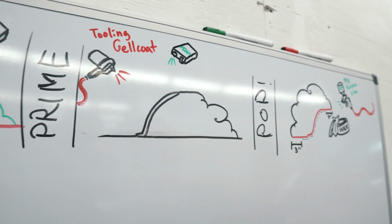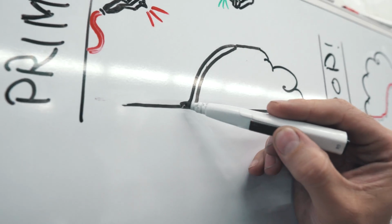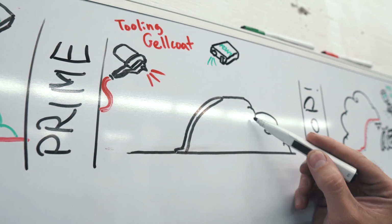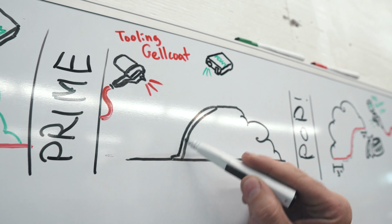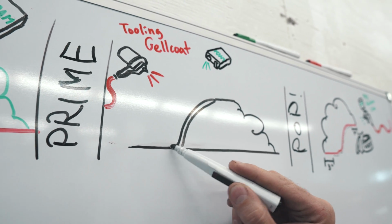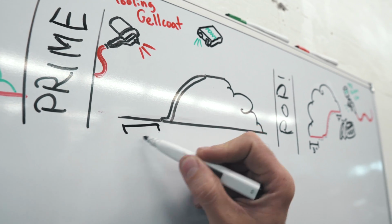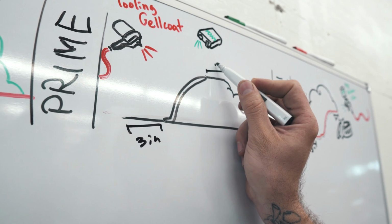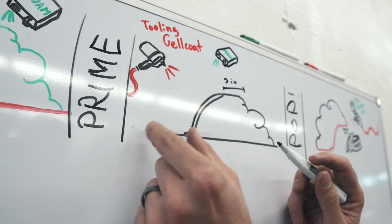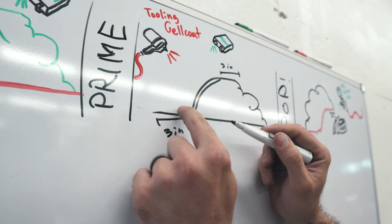So now we're in stage 2. So we'll have something that looks like this. Have the aluminum bottom, the actual fiberglass flare, and all of this foam inside right here. And what you want is a nice even line with the top and the bottom. Maybe you want a little divot to show where you have to trim it later. And then you want about 3 inches between where your part ends and the lip of your mold. That'll give you room to actually make your part, because when you make your part, it'll come up a little wider.